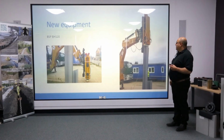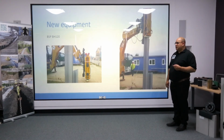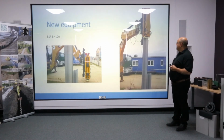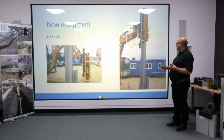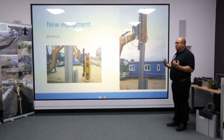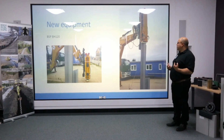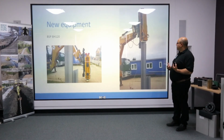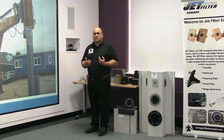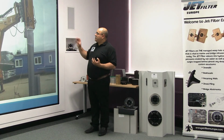In the video you will see that we're getting some quite powerful impacts through the actual plastic piling. 1,200 joules per blow. This is a substantial amount of energy and just shows you how durable the plastic piles become. Now what you'll see throughout this video is quite a steady installation rate, which is typical for impact hammers compared to vibrators. However, we'd often envisage this sort of hammer now being used to back drive a pile once it's reached refusal using a vibrator.